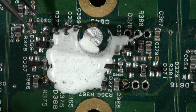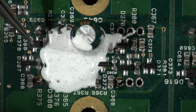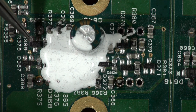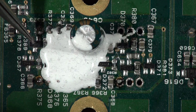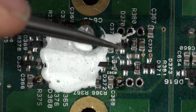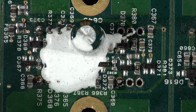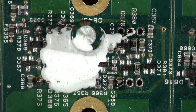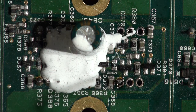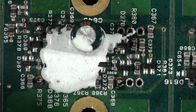On this side, you've got these components to worry about. One of these is a fast switching diode in the gate driver circuit, and it's got an 84 ohm resistor across it. When these FETs go, that diode blows. I should have prepared for this a bit better. Preparation makes up for piss poor performance — but I thought I would do the piss poor performance instead of the preparation, frankly. This is just a shout out for anybody who's stuck on this thing.